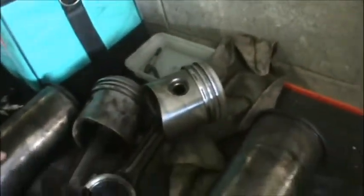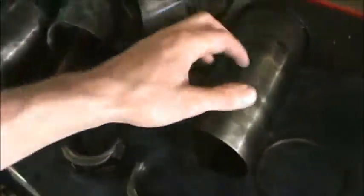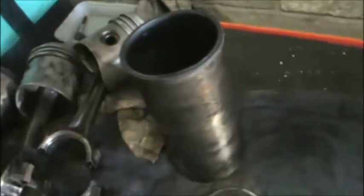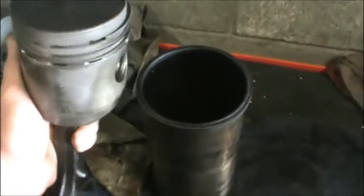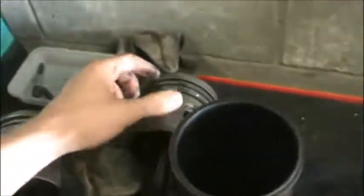This TD340, right? I told you guys that somebody left it and rain got inside the motor. Got down in here. This is called a sleeve. It's kind of like an engine block. In a car, cars don't have sleeves that come out, but pieces of machinery usually do. So this is what's called a sleeve liner, and this piston actually fits right up in there like that. See, it'll fit. And so basically it'll sit in there, but the water gets in there and it'll compress.